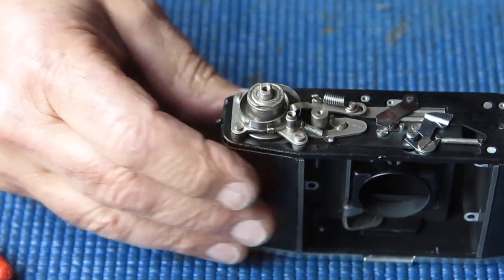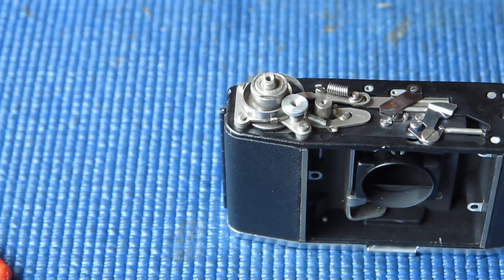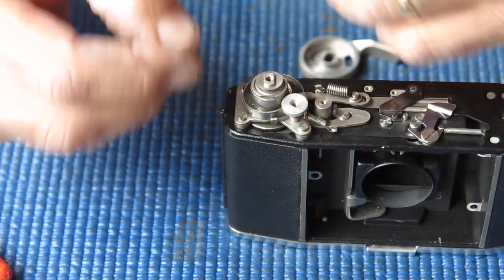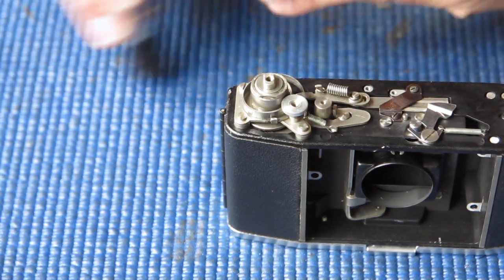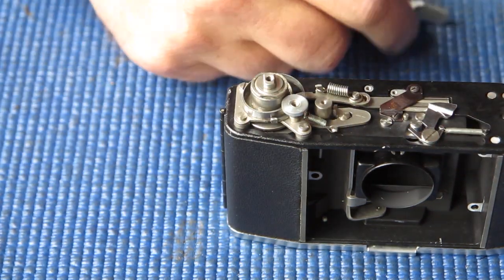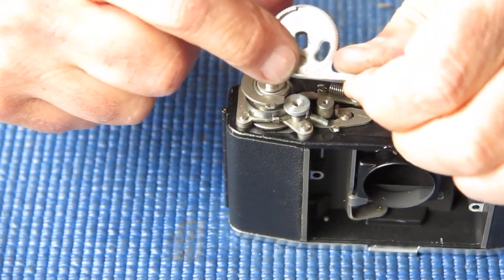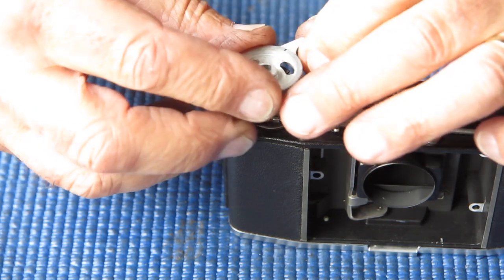You can see that the spring tail is tucked in correctly - that looks good. Now that little keeper goes on the top, normally held down by the top cover. A little spacer goes on top of it on this particular camera - that may or may not be present on all of them, could just be like a shim. This piece goes on; this allows our advance lever to couple at this point. This is our return spring and the inner piece actually moves the film advance.